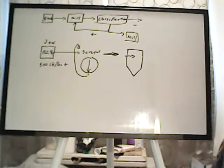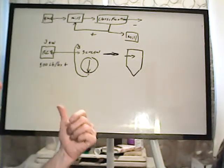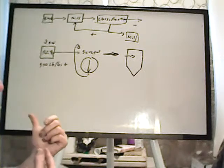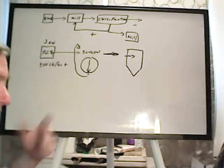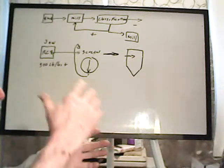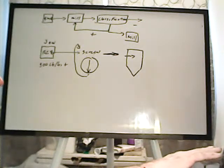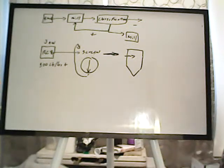There's some serious weaknesses in the ability to analyze it. Number one is I don't have a good head grade analysis. I wasn't doing every batch and splitting a sample and all this other stuff. And number two, what I would do is drain the agitation tank over to the slimes area first. Then I would open the drain valve and hose out the rest of it onto the non-slimes area. And that's what I was testing. So that is the coarser material, which again throws the skew.